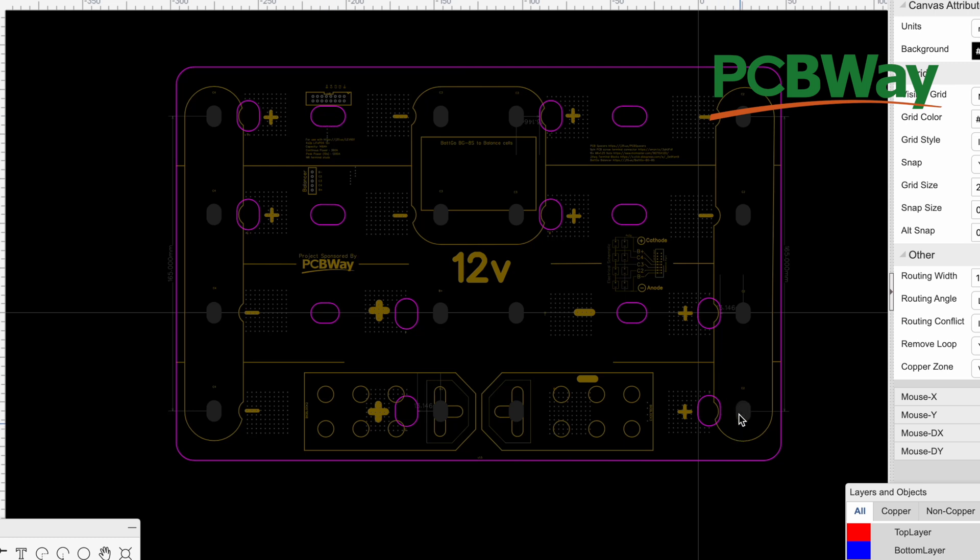These holes here are so you can put this board all the way to the bottom and sit right on top of the cells. Before we were using spacers to help carry the current, but because this is such a beast — 1200 amps is quite a lot of power — we need all the real estate. Those bolts on those cells are not very long, so we need every millimeter. This portion has to carry 1200 amps, which requires really thick materials — either copper or aluminum, and in this case we've chosen aluminum after many iterations and tests.